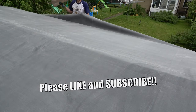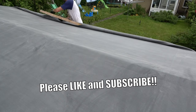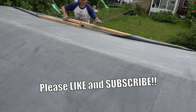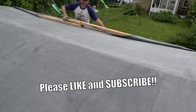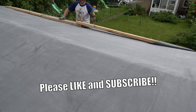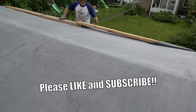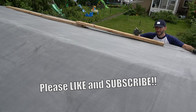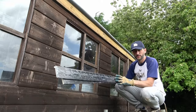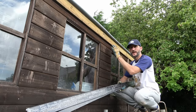Using some timbers to hold back the membrane, this allows me to fix the plastic drip trim into place while the membrane is settling on the roof. I'll also use these timbers later when applying contact adhesive. Off camera I've been working out where to position the drip trim. If you're using timber it's a lot easier - just place it below the edge of the roof and nail it. Unfortunately the plastic drip trim comes in a set size and the way my existing timber lies means if placed in the usual position the drip would be above the bottom of the timber, which isn't good.